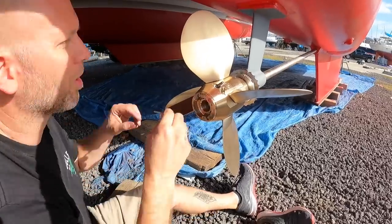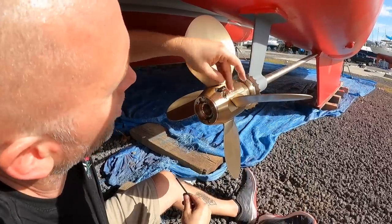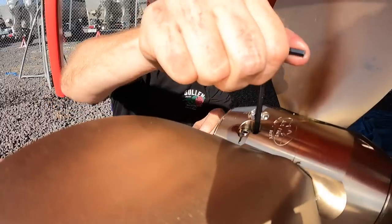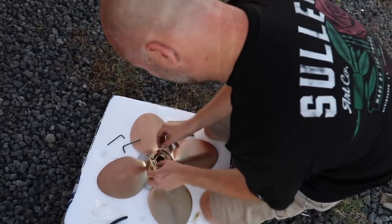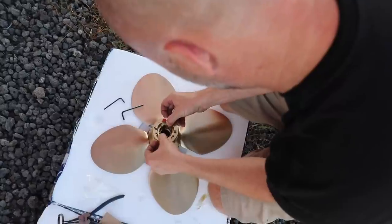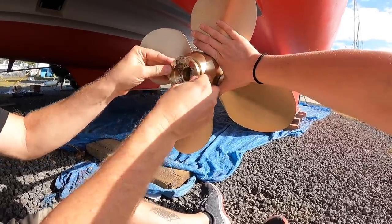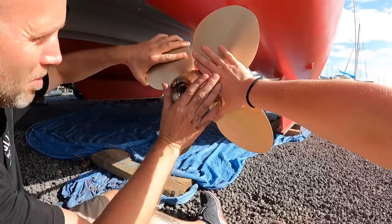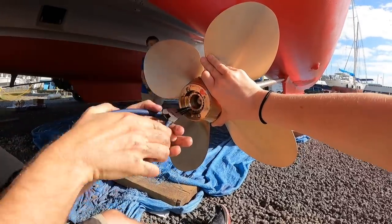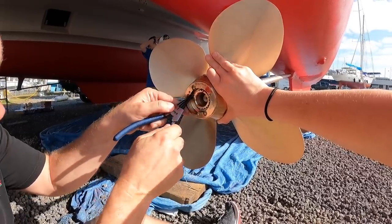The little set screw goes in and holds it in by the bolt's edge, so you have to make sure it's on a round spot. Right now it's set up left. I removed the circlip and then I just lift this up — you can see the little tick mark is set to left. I just change that and put it on R for right. Just slide it back on, rotate it until it pops on, and now you can see the right is lined up right here. Put the circlip back on. It's good to take something and make sure you can spin that circlip because it will seat itself.